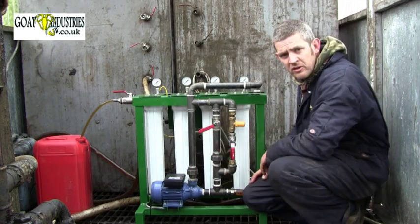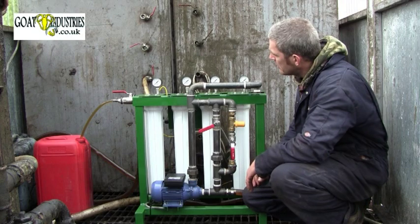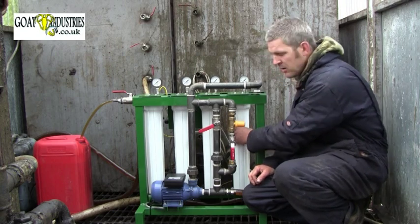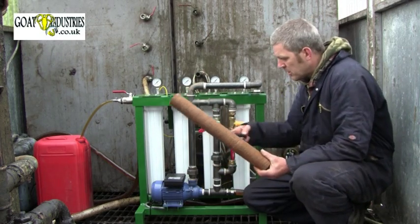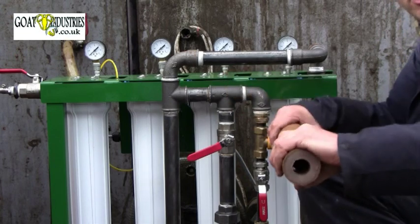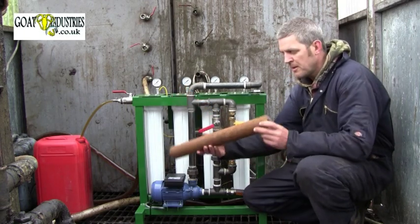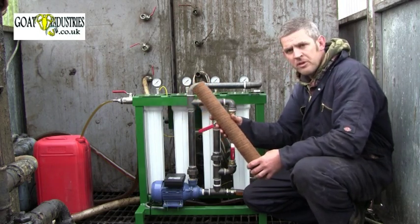The pump itself is a TAM 105 and it's rated to 3.5 bar, which is why we need all these diversion valves and the electronics and the final filter. There is a way of getting around that and that's to use a high quality filter cartridge in the system. The housings themselves are rated to 6 bar so there's nothing wrong with them, but what we could use is ProBond cartridges which are rated to higher pressures and are much tougher. You could drive your car over these things — they will withstand the pressure that the TAM 105 puts out. Obviously there's a downside in that they're more expensive, but they could be used with a cheaper and simpler machine setup.